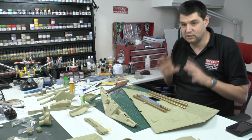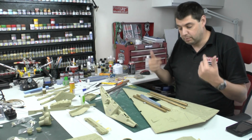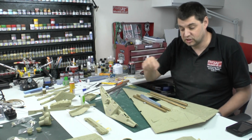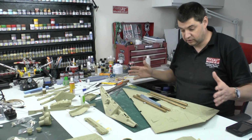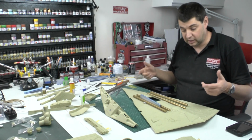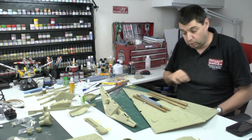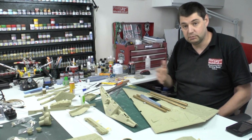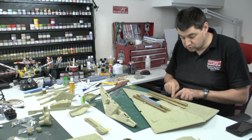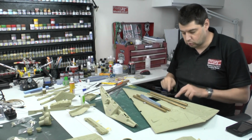When I say it is literally tacked, what I'll do is once it's dried off in about half an hour, flip it over, and I'm going to use some plastic card and just tack it in a few other areas to make the join across. Okay, when we're happy with that, what we're going to do is flip it back over properly, knock up some resin, which I'll show you about doing, and we're going to pour resin in these joins and seams and everything else like that. And what we'll probably do is mask this side so we know we don't get any resin flows through and then out and causes a problem.